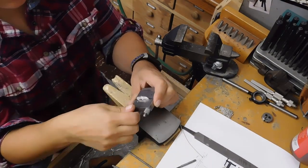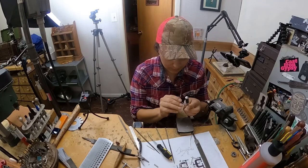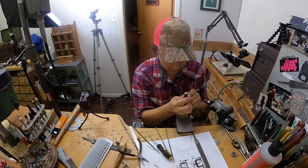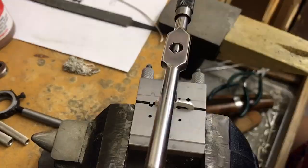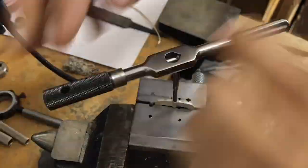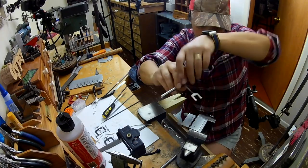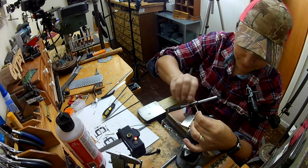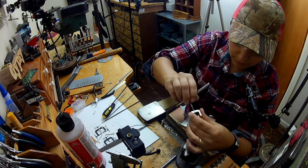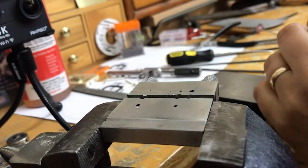I'm gonna drill the inside of the tube. If it's slightly undersized, that's good, because then right before you tap it you drill through and make it exactly the inner diameter it needs to be tapped by the tap. I was able to clamp it in that little hand miter jig and now I'm tapping it — it's going so well because that's such a great holding device.